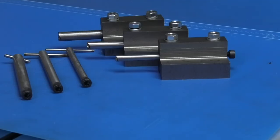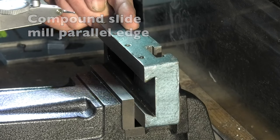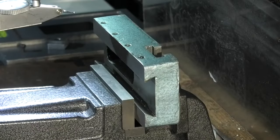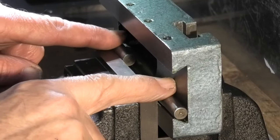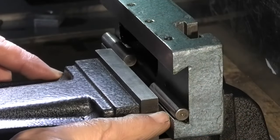This is the boring bar kit. We have three boring bars fitted in the blocks and three thread cutting bars. So what I want to do is mill a flat surface down here, about a half inch wide, just to give me a guidance for a dial indicator to run along. So now I can run a dial indicator over the top of each and get this level to the dovetail.